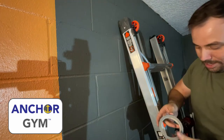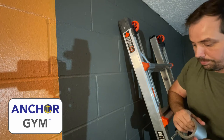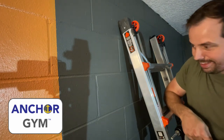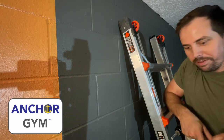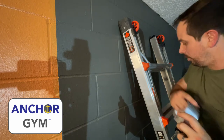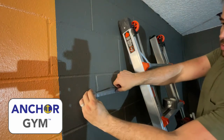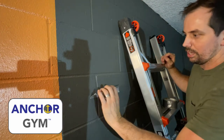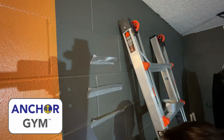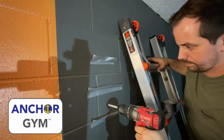One really quick tip: get some painter's tape or duct tape. I've made the mistake of drilling pilot holes into concrete when I had already put my gym mats down — concrete dust and gym mats don't go great together. If you put some tape on the wall underneath where you're drilling and fold it back, it will actually catch a lot of that dust. Let's drill it out.